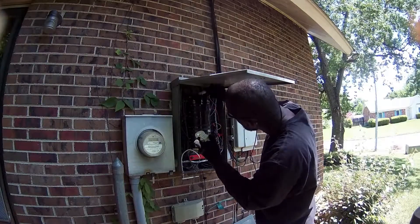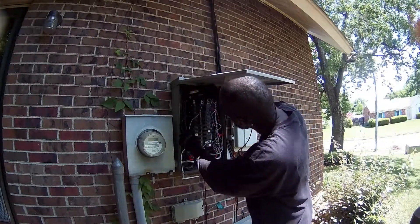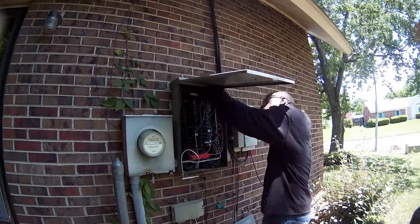After wiring the red and black wires, wire the white wire to the neutral bar. On either side of the breakers there should be a bar where a bunch of white wires — and possibly ground wires — are connected; that is your neutral bar. Next, connect the transformer clamps to the two feeds coming into the breaker panel. My wiring comes in from the left, snakes up the side, and connects to the bus bars at the top, so I placed my transformer clamps there.